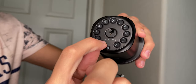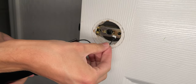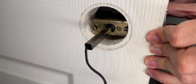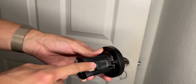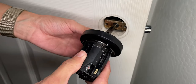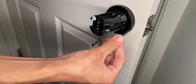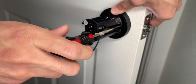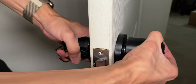Next, get started with the exterior assembly — make sure everything is facing upwards, numbers around the top, keyhole facing vertically, and the 'up' marking on the metal rod is oriented correctly. Feed the wire through the middle followed by the metal rod, lining up the two cylinders to go through the holes in the latch. Then take the interior assembly, ensure the red reset button and wire input are on the latch side, feed the wire through the square hole, line up the metal rod, and tighten the screws — different sizes are included depending on your door thickness.